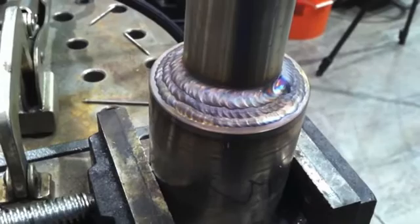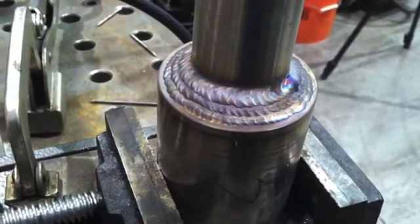And again, I'm using a 1/8 filler rod here. I use 130 amps all the way out. I'm using a 3/32, which is a 2.4 millimeter electrode, 2% thoriated. I just happened to pick up a thoriated. I generally use 2% lanthanated for everything. And I'm using 20 CFH on the argon flow meter with a number 7 gas lens cup here. And that's the final cover pass.